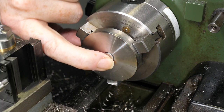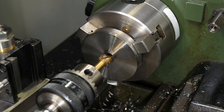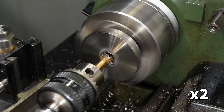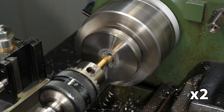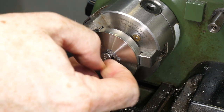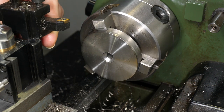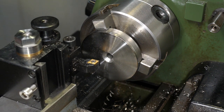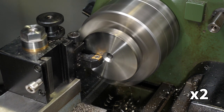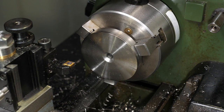On first check, the countersunk head sticks out a bit from the face, which will prevent the plate from sitting flush, so it needs to be a little deeper. There's quite a big burr left around the countersink, so that needs to be removed. Using a regular lathe tool seems like the easiest way. The lathe work is now all done.